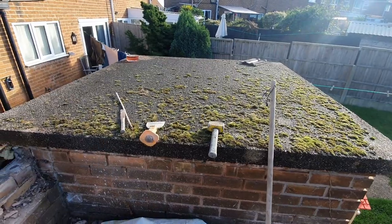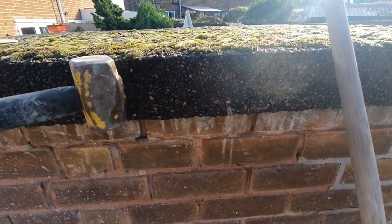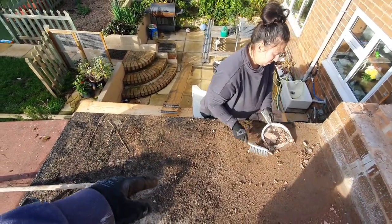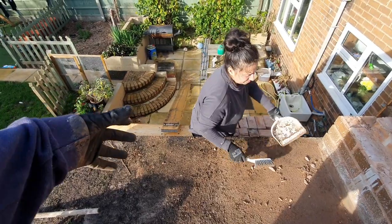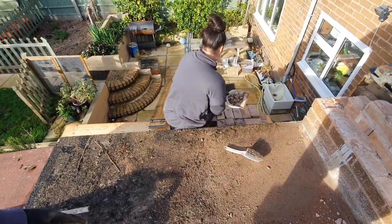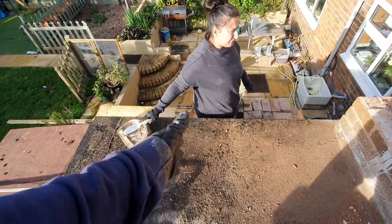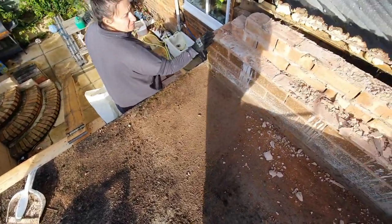It's basically one of those — you can see how thick it is. If I put a bolster next to it for reference, it's pretty thick. So what we're going to do to take this down: I've got it propped up in the centre. I'm going to do some cuts this way and remove like a sliver, another cut, remove a sliver — thus keeping the whole of the main slab intact. No cuts this way because there's no supporting wall down the centre. I've got some acros in there, but that's the plan.